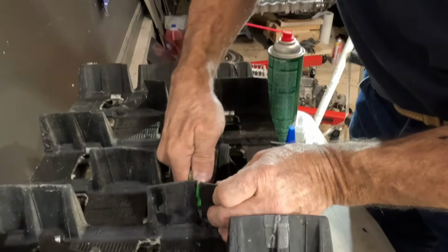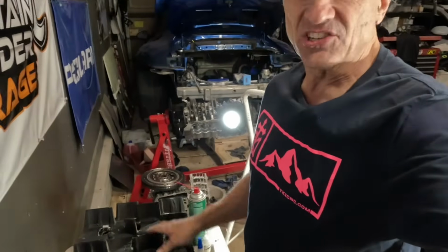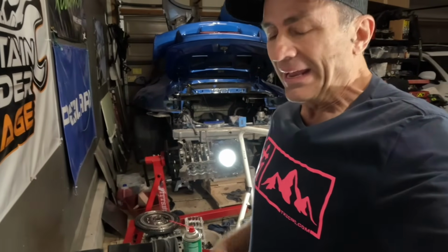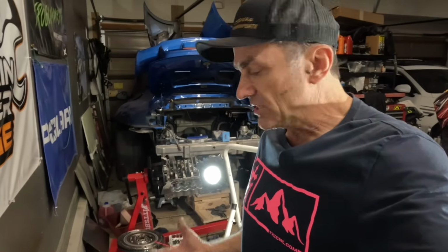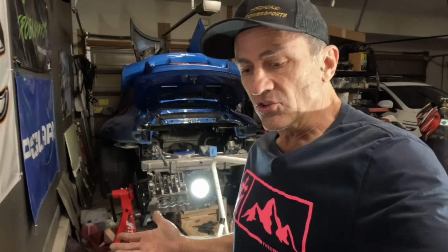So as we get this down here and finish cutting that piece off, I mean, this is a pretty ragged track. This is actually my early season track. I put this on at the beginning of the year when the snow conditions aren't very covered yet, and I know I'm going to be spinning over a lot of logs and tree trunks and rocks and whatever else is on the ground, because the snow's only like 24 inches deep and you're always going to spin down to something. So I'll put this on for the first month or two of the year until the snow gets really deep, that I can trust putting on my good track for the rest of the year.